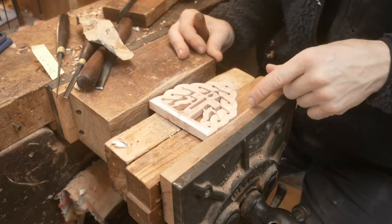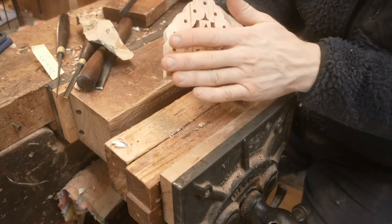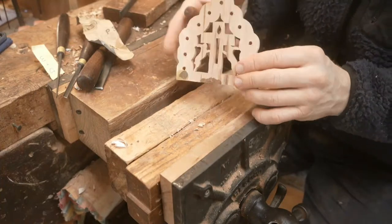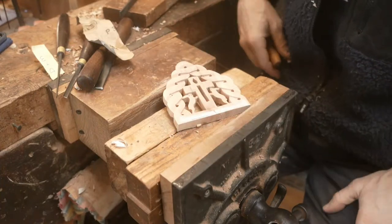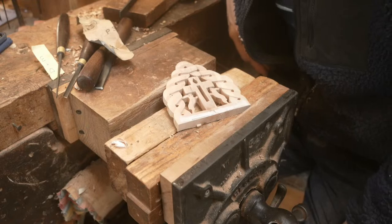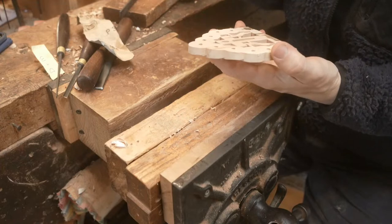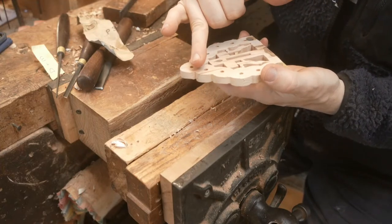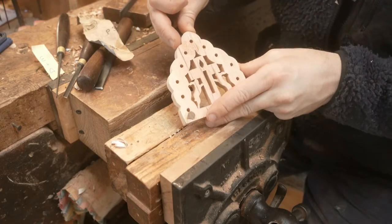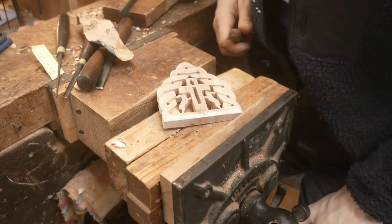As you can see, we put it on the belt sander, take that off, and then I will also use the belt sander to sand this one on the back. We put that base, possibly a couple of pieces of wood to secure where the candle holder, the little tea light, and those electric tea lights that we use will go into. But a nice little project, a beautiful piece of ash. When we put the shellac on, one method I use to show you the colour that it comes up, just wet your finger like that, and then you can see it'll come up a nice sort of golden colour with nice grain lines on it. There we are.